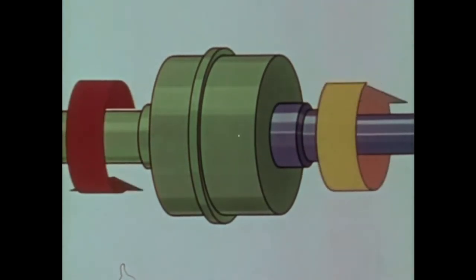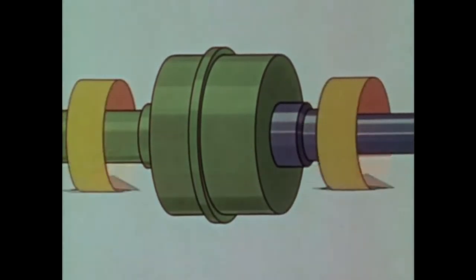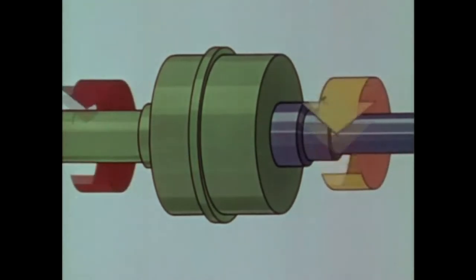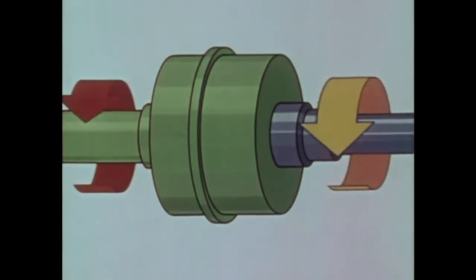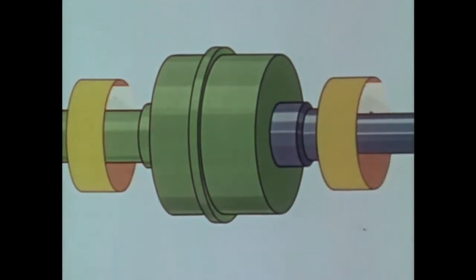But they can rotate independently for a small fraction of a turn when the tractor or the implement encounters heavier loads and puts extra resistance on the rear half of the load monitor. This differential in torque loads between front and rear halves of the drive train is what load monitor senses. In principle, it works like this.